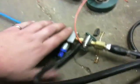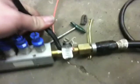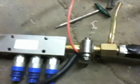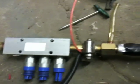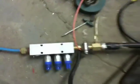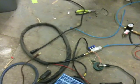This is the quick manifold that I threw together to get the power into the line, because the hose on a plasma torch is your negative feed as well. So I've just got a piece of brass pipe in there with a hose clamp on it, just for now. When you're the only one dealing with this stuff, you can take a little less precaution — nobody else is allowed around this.